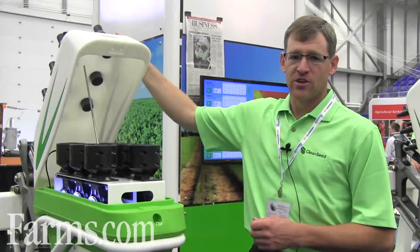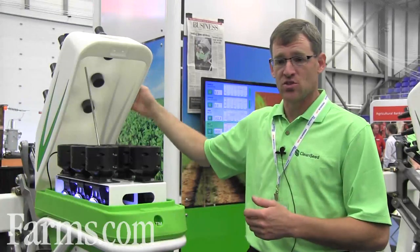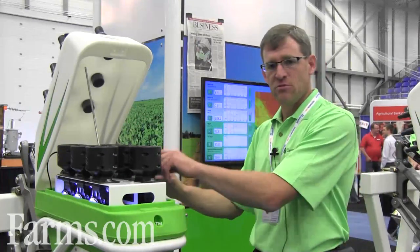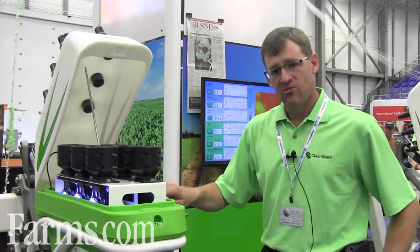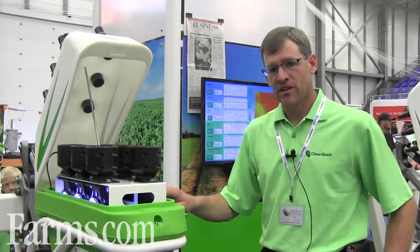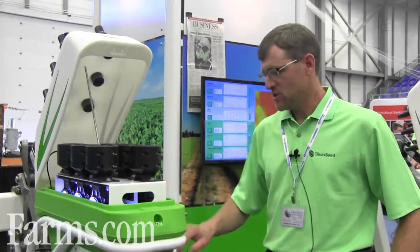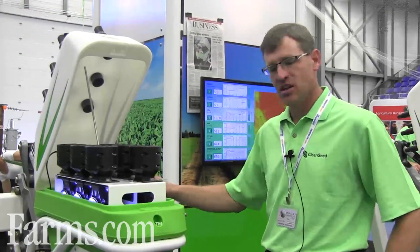It's delivered by a central fill system, same as common planter technology. All planters with central fill systems bring product on demand to keep each mini hopper full of seed and ready to seed. There are foam meter rollers inside driven by electric stepper motors that we can run from very low speeds all the way up to high RPMs to get any rate you need of every product.